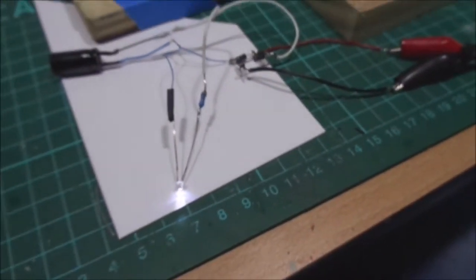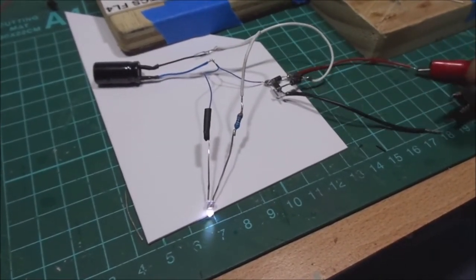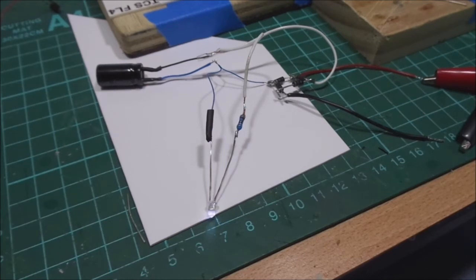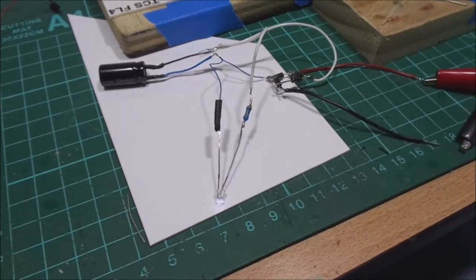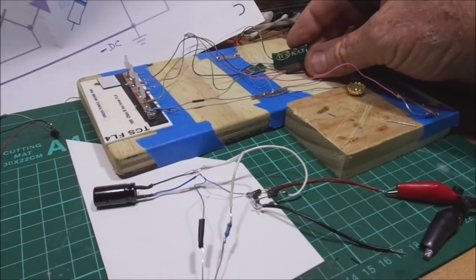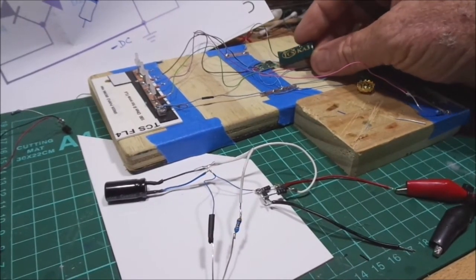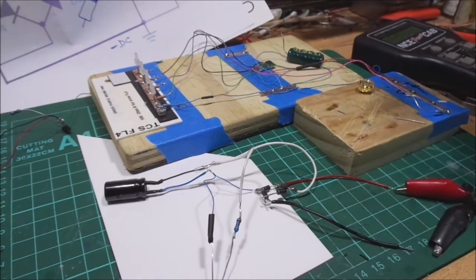I'll take this power off and we'll just see how long the LED lasts. Okay, that's off — the LED is still on. Still on, still on, still on — and still there. Just gone now. That's enough to stop flickering in a caboose or a coach. So you can make your own, but the other option of course is using the TCS keep alives. They've got several different ones — the KA2 is even smaller. Your choice.